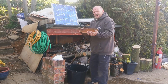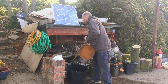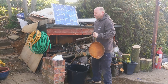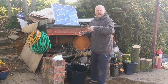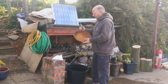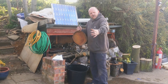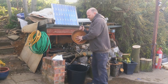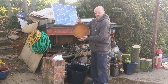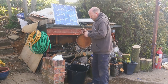Before we actually rig it all up, the basic science behind it is: we're putting this in a bucket of water and putting a sacrificial piece of metal at the opposite side of the water, and we're running a current between the two of them. So we're putting electricity through water — you might not think that's a very good idea, but trust me it's alright. Basically, the current going between the two through the water pulls the rust away from this onto the other piece of metal, making this nice and clean. That's the theory — let's crack on.